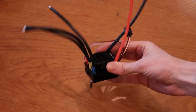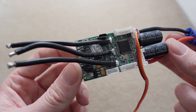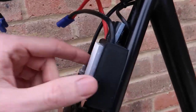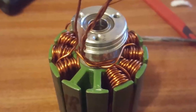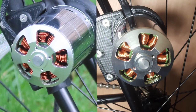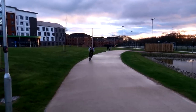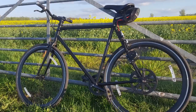I didn't want to spend too much money on a project that might not work, but I also didn't want to risk burning out another motor, so I purchased a VESC. This speed controller was twice the price but had current-limiting capabilities, meaning the motor would essentially never burn out if I set the limit correctly. I also ended up rewinding the motor by hand, which is why the coils in the original electric bike video look different, and it was this rewound motor and VESC setup that powered the bike in my first electric bike video back in 2017.